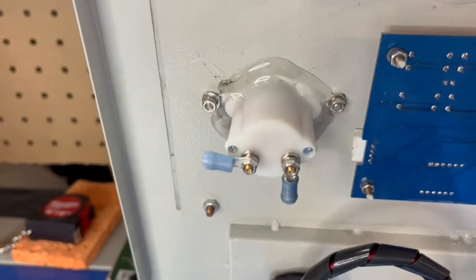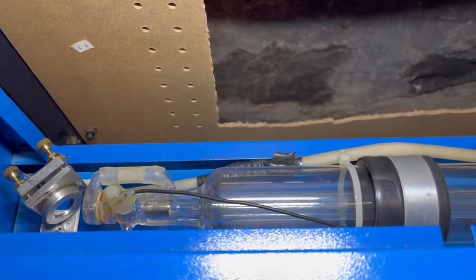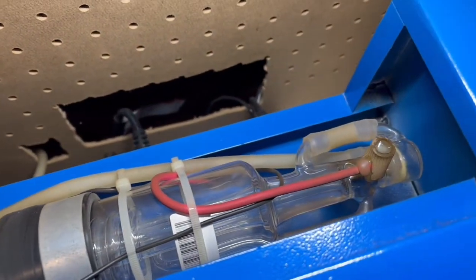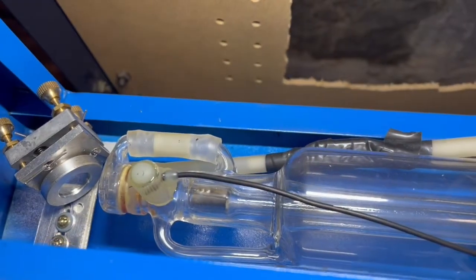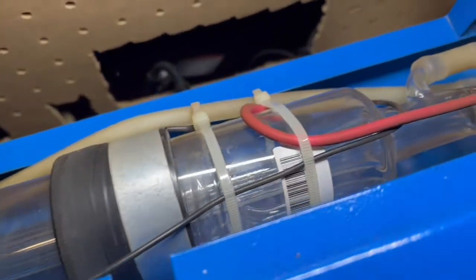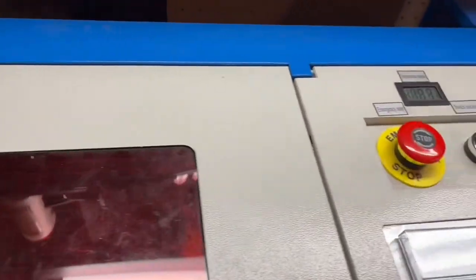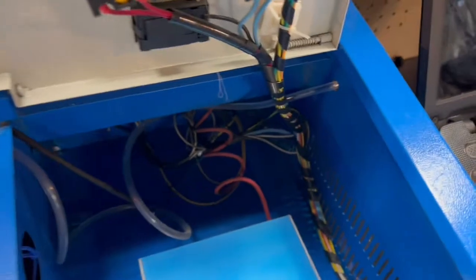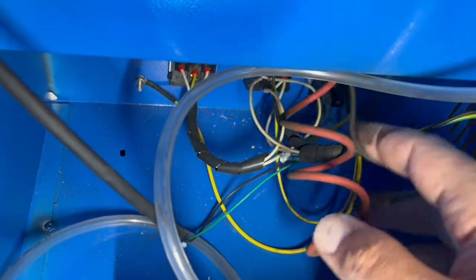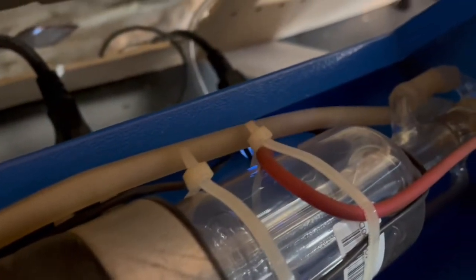For this next step I removed the cover for the laser tube. What you're gonna want to look for is the negative side of the laser tube. As you can see, we have the thicker red wire which is gonna be our positive side, and then over on the other side this is gonna be the negative side. This is the wire you're gonna want to trace back into the control panel — it goes right back down inside. We're gonna open that control panel up and see if we can find where that wire comes in. If I wiggle that wire you can see that black wire wiggling right there.